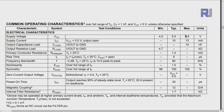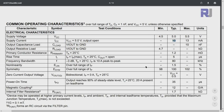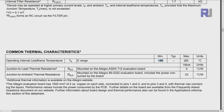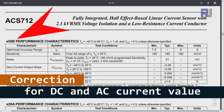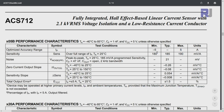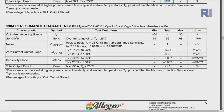The operating voltage minimum is 4.5 volts, maximum is 5.5 volts, and typical is 5 volts. Current consumption is 10 milliamps. Operating temperature range is minus 40 to 85 degrees Celsius. For the 5 ampere version, the sensitivity ranges from a minimum of 180 to a maximum of 190 millivolts per ampere. This causes a deviation or error of plus or minus 1.5%.